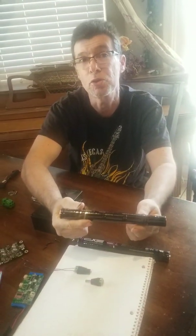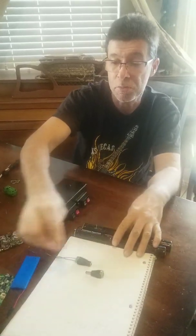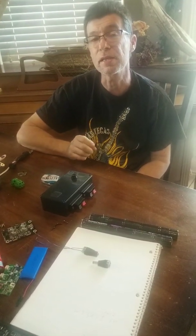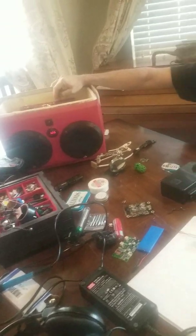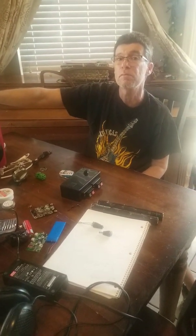They're not prone to blow up and explode like a lithium or this polymer, which means when you're charging with these blocks, they do not shut off. There's no stop on it. You can't set a timer. Once I plug it in to charge these batteries inside this cooler, I have to time it and run it for 12 hours. I have to put a timer on and run it for 12 hours. Or I can just charge it overnight every couple of days.